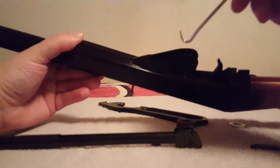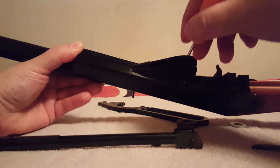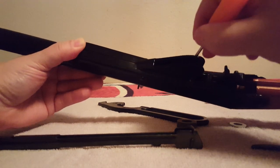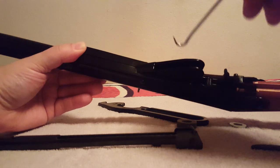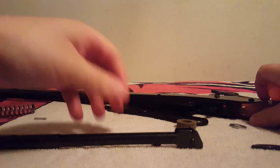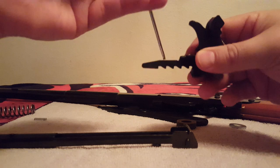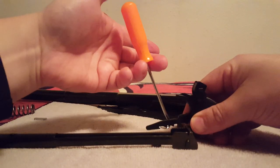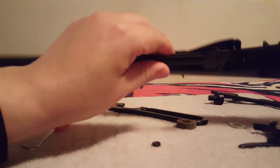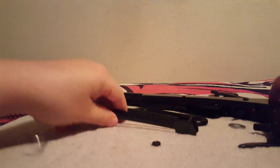On a working gun, when I get in here with a gentle grip, the anti bear trap is in fine working order — it's banging against the frame. When it's not that way, there's a jam and you need to grab it with a power grip and pull up. Pull up, and then your plunger will shoot forward and your gun is fixed. You should oil it while you're here.